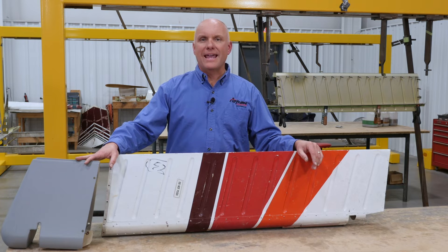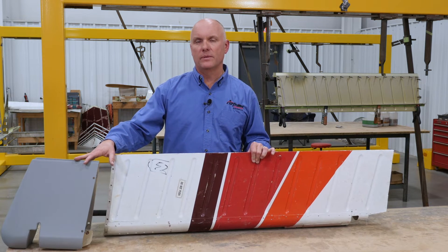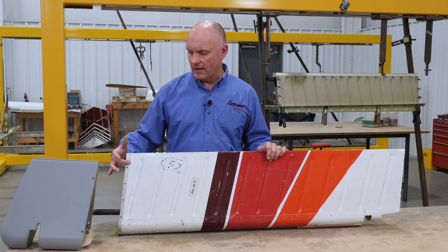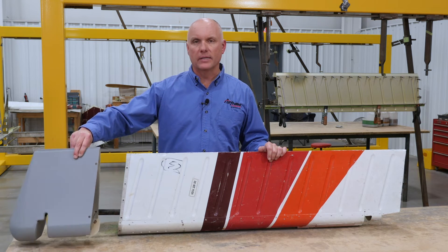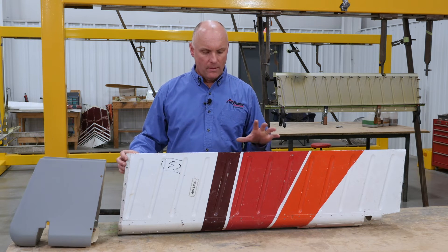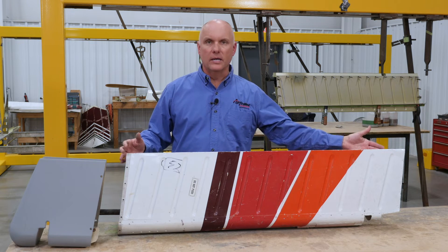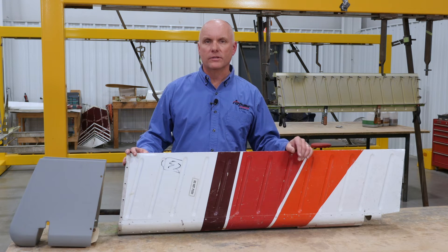In 1978, in the heyday of general aviation production, Piper introduced the T-tail aircraft. We had a T-tail Arrow and a T-tail Lance — the PA-28R and the PA-32R. I have in front of me a T-tail Arrow rudder. The T-tail Arrow rudders are easy to distinguish because they have nut plates installed along the lower surface of the rudder and a fiberglass fairing installed at the bottom. But essentially the T-tail rudder was the same design — just a spar, an upper rib, and a lower rib, with a fluted skin giving all the strength to the structure.